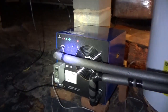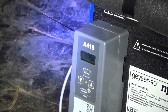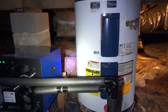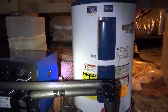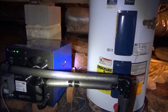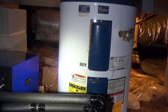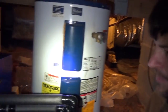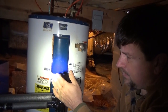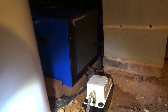The hot water is then dumped back through a dip tube, rises up, and keeps looping. It has its own thermostat - you can see the 419 thermostat, I think it's Johnson Controls. Right now it's at factory default of 125 degrees. We started with 50-degree water so it's going to take a while - we're at about 75 now. Because it's a heat pump, like an air conditioner, the byproduct is condensate.